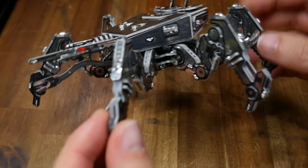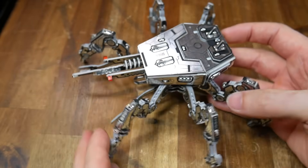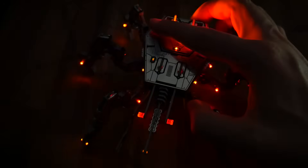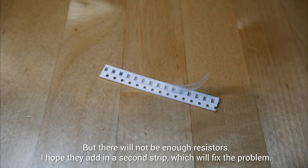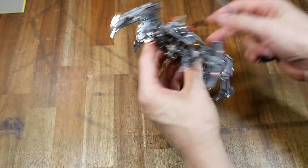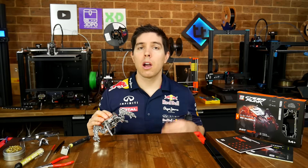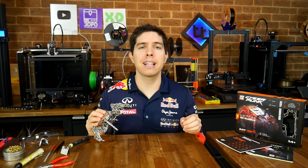Finally, how about the actual kit as a project to complete and as a finished product? Personally, I was very pleased with the outcome, and I really like the design and attention to detail on this model. It's surprisingly hefty and solid once it's all constructed, and it looks incredible when it's all lit up. However, if you want to build it with all of the optional LEDs in place — and if you mix and match the LEDs you will have enough — you will be limited by the amount of surface mount resistors, so you're either going to have to leave out some LEDs or supply some additional resistors of your own. My only other suggestion is that the battery is quite awkward to get to, and I needed to use a long hex key to remove it and turn the model off. Having an on-off switch would be a very welcome bonus. I was frustrated at times, but overall I still think this is good, and the changes needed to make it great are quite minimal, so hopefully Geek Club are listening to my feedback.